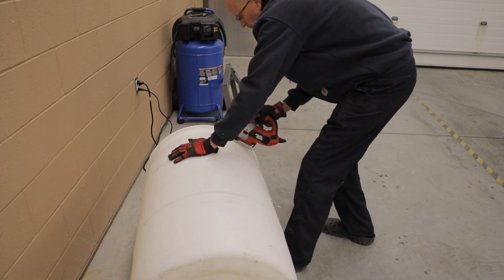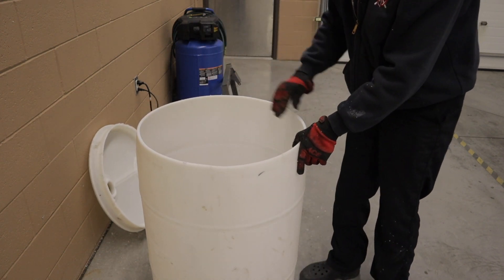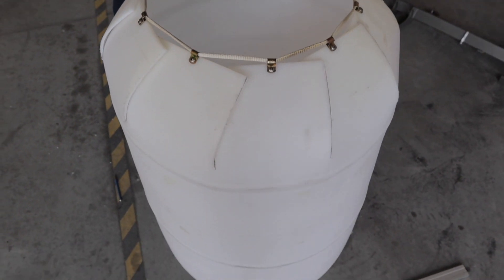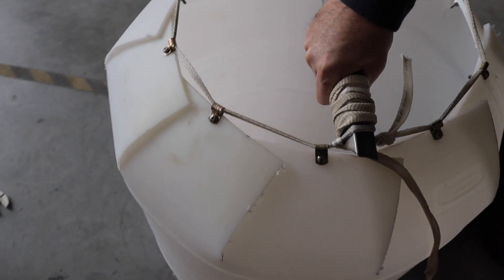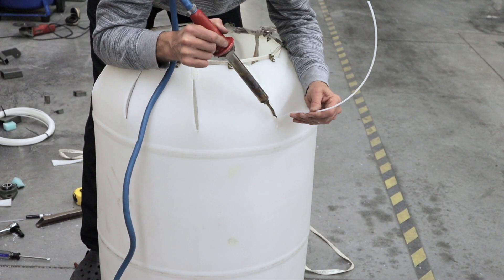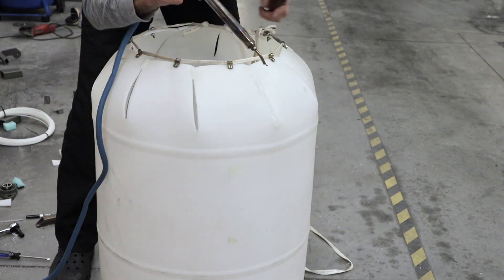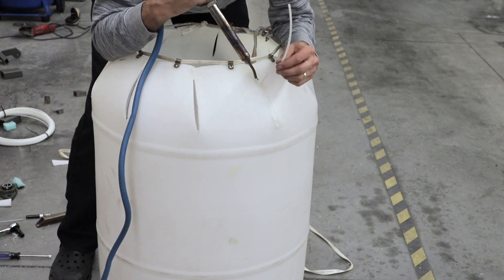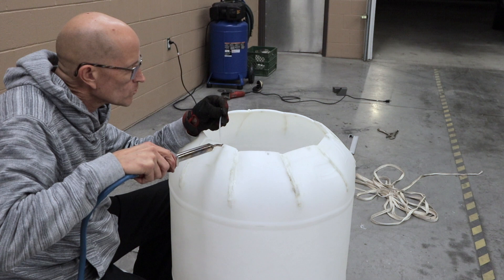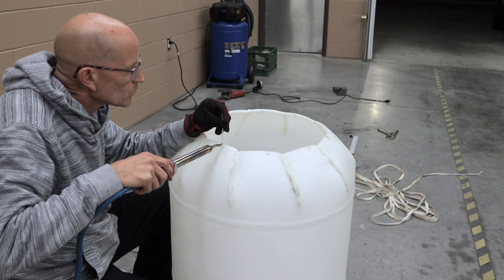Here I am cutting the top off of the plastic drum. Once I got the top removed I knew I needed to put some structure and some curvature in the top so that it would have some stability. So I cut the sections around the top to fold them in like a flower so that I could weld it back together. I put some brackets and used a piece of cord to hold it in place while I marked each petal of the flower on the top edge so I could cut it afterwards and weld it back together for structure. Here you can see I'm plastic welding the pieces — I went around and basically plastic welded all of the joints so I would have a rounded end. Then I filled in the holes for where I had the little brackets screwed on to hold the cord.